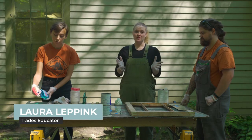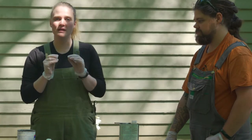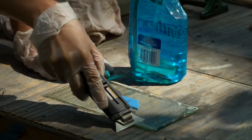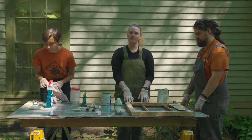The first step is to clean your glass. We want to make sure that we have good adhesion between the glazing putty and the glass, because if our components are dirty it can affect how the pieces of glass will fit back into their spot in the window.